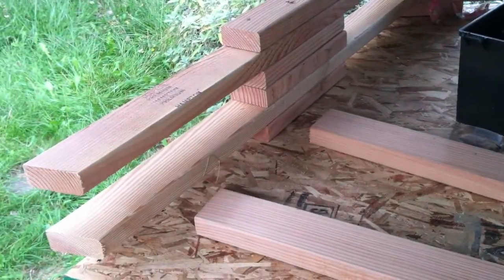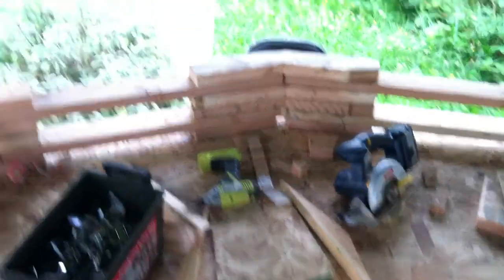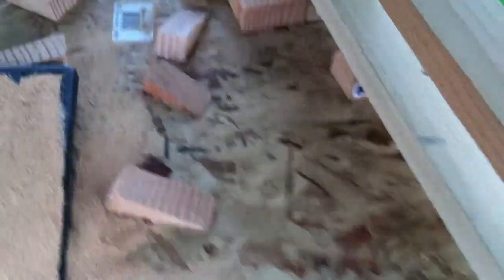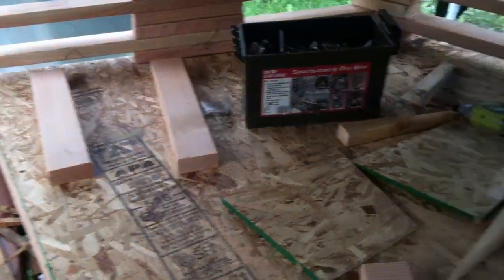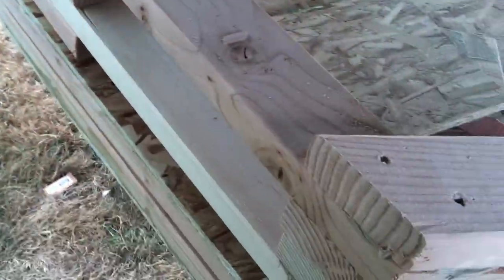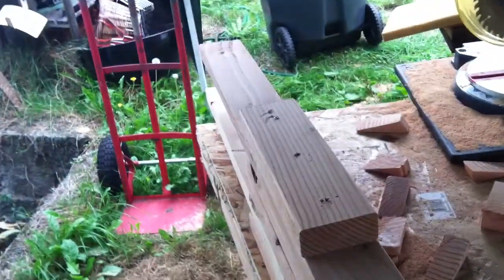One of the more time-consuming elements is roof trusses. You can see here, this is a barn roof type of arrangement — a gable roof. The loft is going to be almost full height ceiling, so I need to salvage as much headroom as I can where the gussets won't get in the way. I take a four-by-eight sheet of plywood, measure in one foot, draw a line to the opposite corner, and cut that off. This becomes our angle — roughly a 15-degree angle.